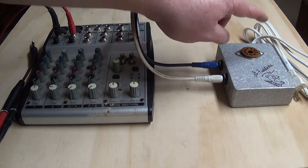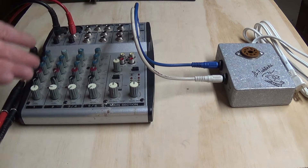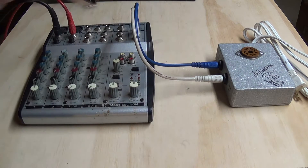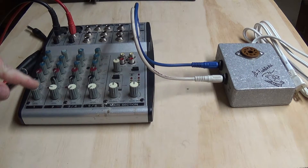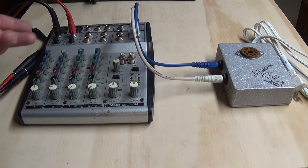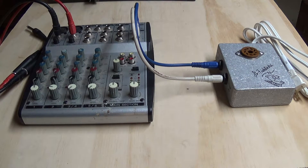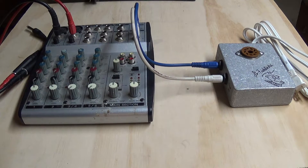Going to your Leslie connector — this 9-pin goes to the Leslie. This also works with the 11-pin. Now your one input can be sent to the two channels of the Leslie, and you can adjust their mix. You can adjust the equalization. So you don't need any kind of crossover, because what is a crossover but a volume and equalization change? And now you have a kind of unlimited control on how you want it to sound — you can cut it, keep it down, turn it up, find the balance you want between the two channels.